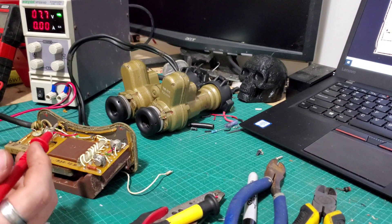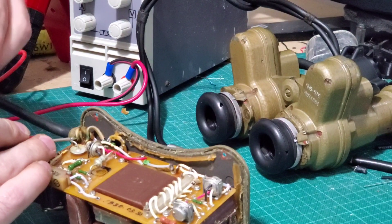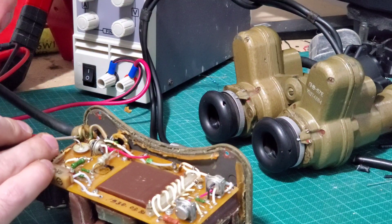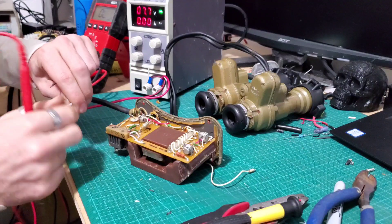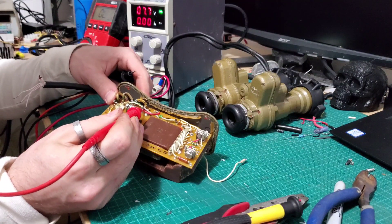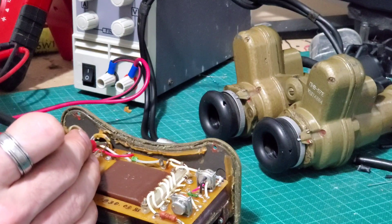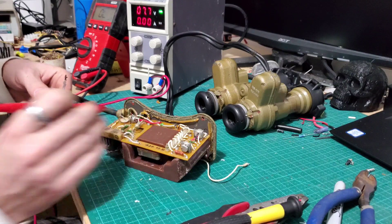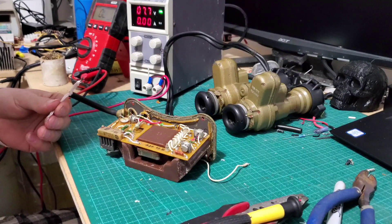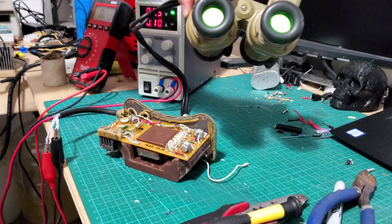To find your polarity, you're going to need a multimeter with a continuity checker. This point here is going to be your negative — there are four wires attached to it, and each one of them reads a short circuit to this point, so those all become your negative terminal. Then there's this little point right here where three wires come in and solder onto this little tab — that's where you check for your positive wires. Twist those three together, and I'm getting 7.7 volts — just an arbitrary voltage — and it comes right on.